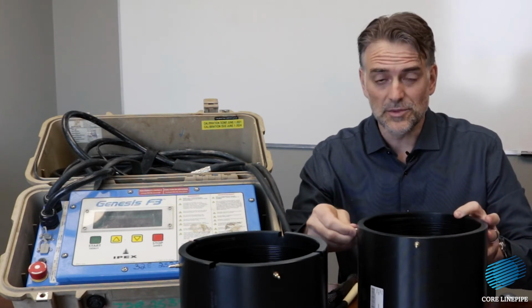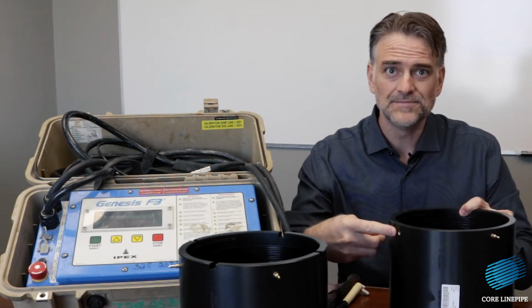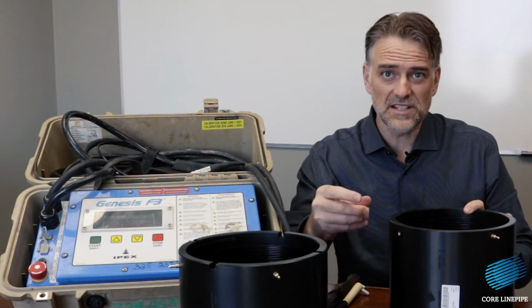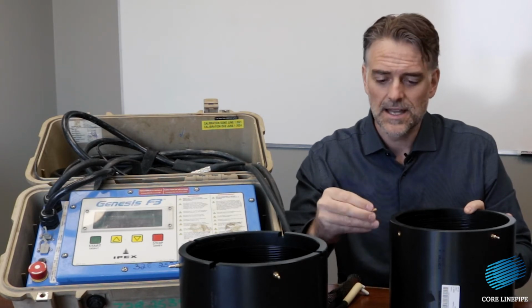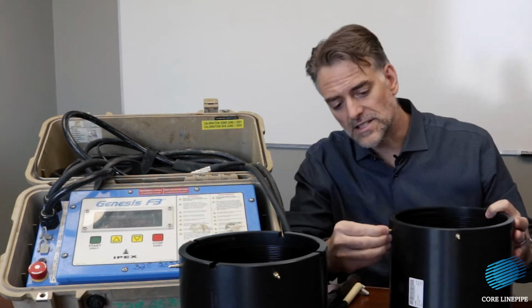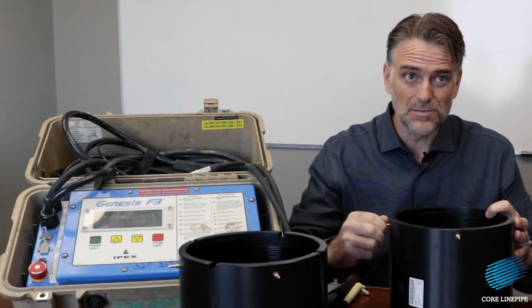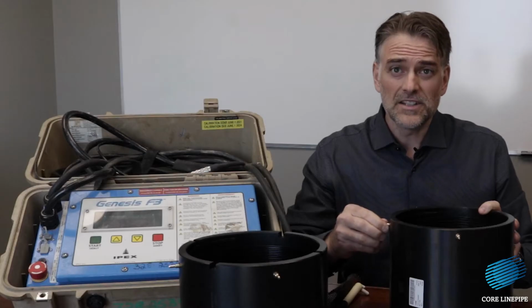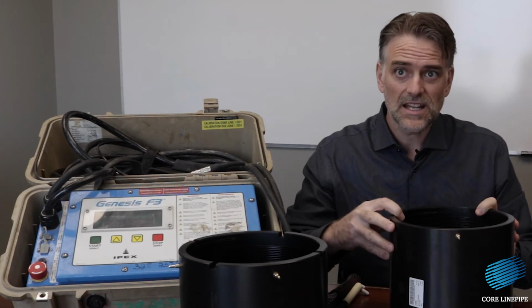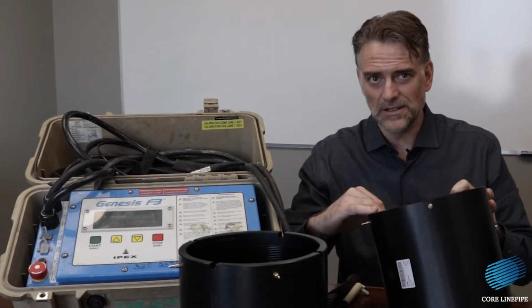In our case, the terminals are made up of a nutsert that's pressed into the coupler body, a grub screw or set screw that sits inside the nutsert and holds the wire in place, and a pin that threads into the nutsert and compresses the wire against the set screw to make a solid electrical connection from the pin to the wire. On the other end of the coil, there's typically a crimped connection, which is melted into the fitting after the wires are plowed.